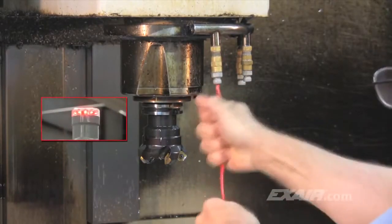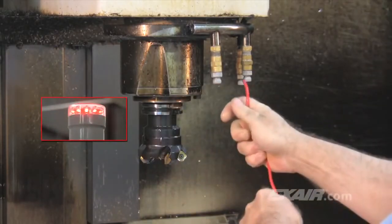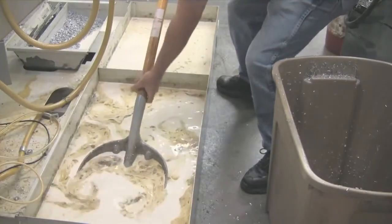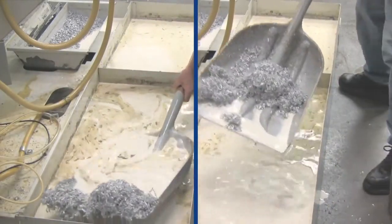If low coolant flow happens on a machine equipped with a high pressure coolant system, an audible alarm sounds, and the machining process stops abruptly. In any case, it happens without notice. There's no choice other than to spend half a day shoveling the chips out of the sump, emptying the smelly coolant, and cleaning up the mess.